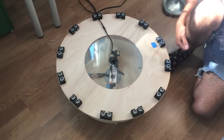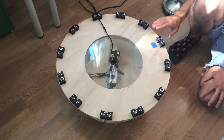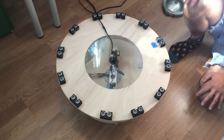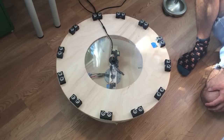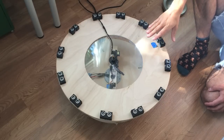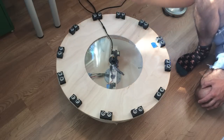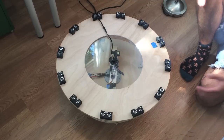On the outside of the laser sheet device are ultrasonic sensors. Their purpose is to enable people to interact with the laser sheet generator. These devices send out ultrasonic waves and detect them — if a hand gets in the way, it picks up the reflected waves and determines the distance. Using that information, you can change the angle of the servos, change the blinking rate of the lasers, and also produce a MIDI signal to make the device play sound.